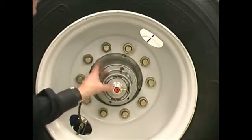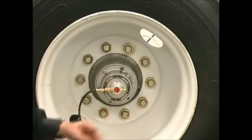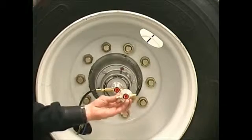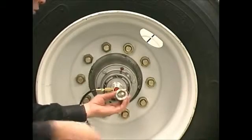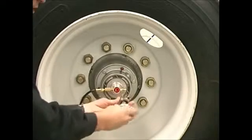So what we know with this hub is that we have a leak in the hub, but we haven't determined which of the components is leaking. There are three components: there could be the rotary union itself, the internal axle plug, or the internal stator that the rotary union folds into.